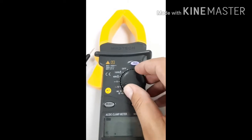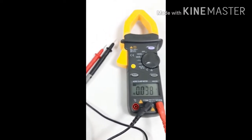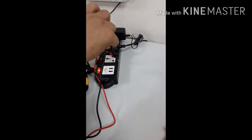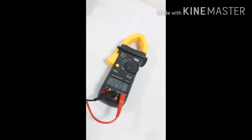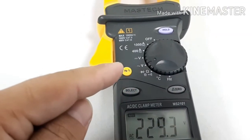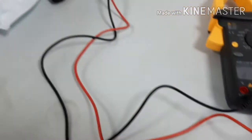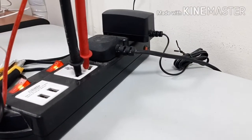For example, if I want to find AC voltage — this is AC voltage. First I will insert the red lead, the red probe, to the extension board — you can see the extension board here. I insert it and connect the neutral and common. Now it will start, switch on, and start reading. See, it's showing 229.5 volts — the voltage is okay, single phase voltage is okay. I already connect it with AC voltage. If you want to hold the reading, push the hold button — it will give you a constant field that will not change.